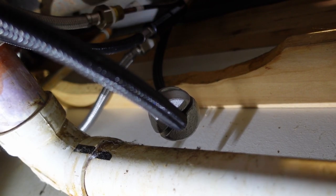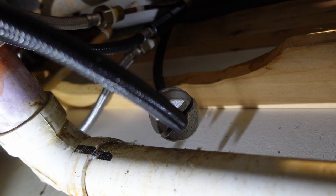The hold-down nut for the main faucet turns out to be really difficult to get to with any kind of wrench. There's a special kind of wrench needed to put that in, and it's an optional purchase from Pfister. I'll go to the hardware store tomorrow and see if I can find one that is the right size, so I can tighten that down because right now it's pretty loose. The next step is to turn on the water and see if there are any leaks.